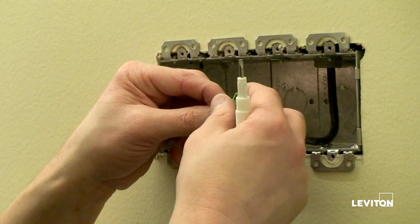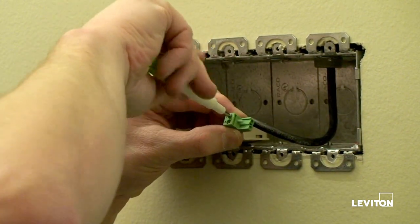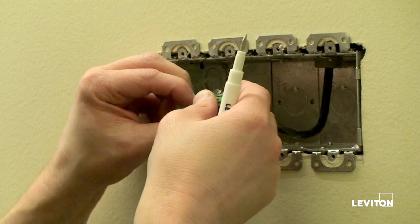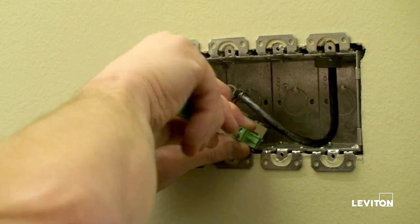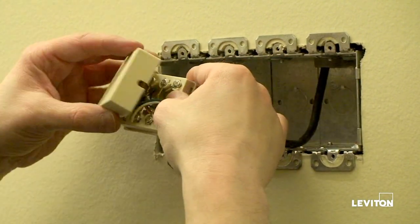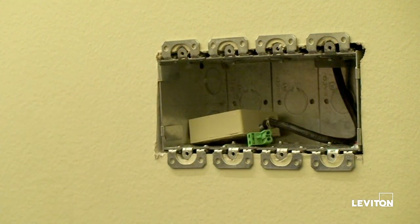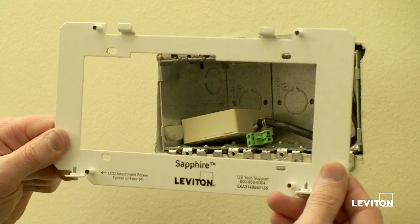Now that we've got the breakout boxes installed at each side of the cable, we're going to install the power connector onto the power lines of the Belden 1502R — the red and black wires like we saw in the previous chart. Get the wires inserted and get the terminals tightened down. It's very important that you get both ends of this cable wired correctly before you proceed further. That means getting the breakout box installed correctly, getting the power isolated, getting Luminet and LumiCAN routed correctly, and getting your gateways installed. Once that's done, lay the wire in the back of the box and proceed to the next step of the installation.